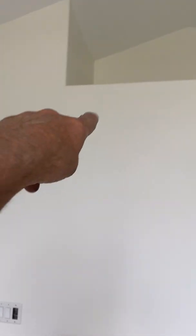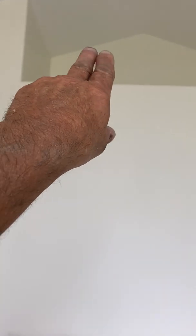you can put it anywhere you want, but we can get to this back wall. I was hoping to get it on the side, but there's a flue and a combustion air right there. But we can get it on the back wall there. So put a 16 by 16 filter grill there. And like I said, no one lives here, so I wasn't able to talk to anyone about where they wanted it, but that's why I would want it back there, so you couldn't see it.